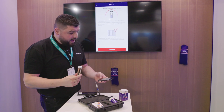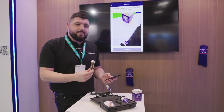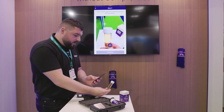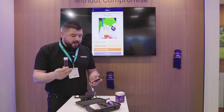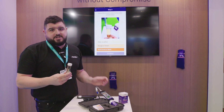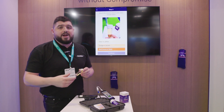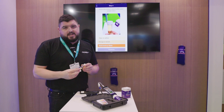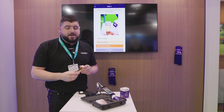We've got our sample now. We're going to press continue on the app and the first thing we're going to do is take a photograph of this sample against a pale background. We can choose between clear or yellow, orange or brown, or dark brown and black. If at this stage the sample was brown or black, it would fail on turbidity and we would recommend a Magna Cleanse flush. There's no point doing a test with a strip — we just need to clean the system and give that advice to the customer.